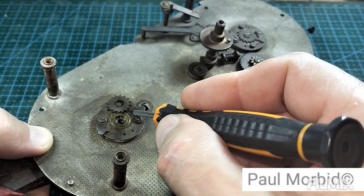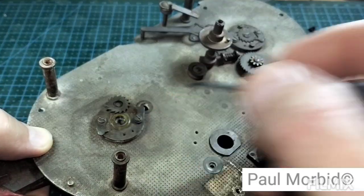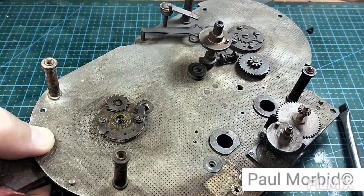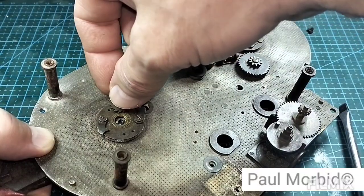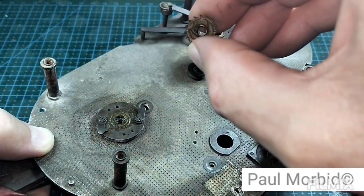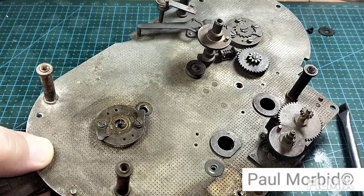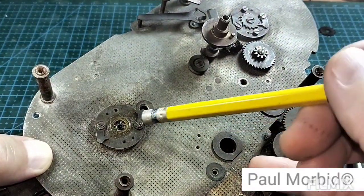So why is your film spilling out into your camera here on this end with a take up? Why is it not moving or moving just a little bit sporadically? Is it because of the old lubrication under here? It's all turned to goo and it needs to be removed. And all this area cleaned, okay?